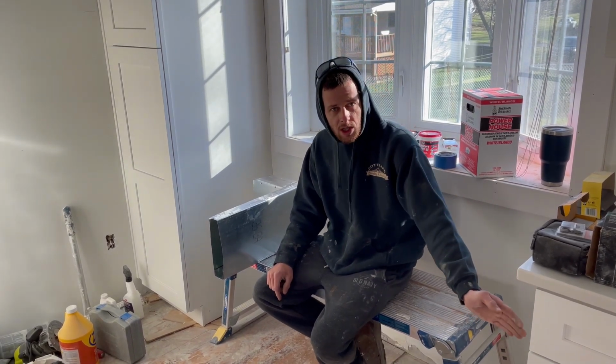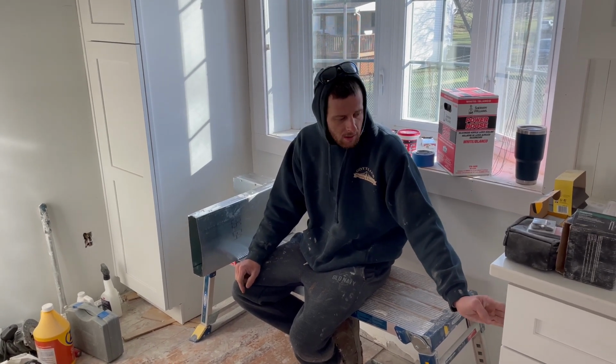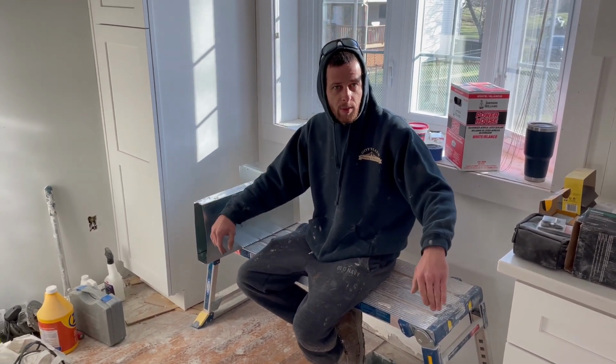Basically, we go 23 inches, and we do a 1.25 inch overhang. Our shiplap is probably about 1/2 inch to 3/4, and we'll probably put sheetrock on the front just to give it a nice flat surface. So that's about 1/2 and 1/2, 1 inch. Our finish is going to be 23 inches minus 1.25 and minus 1 inch. Our rough framing will be 20 3/4 to the edge of the cabinet. You've got to figure all this out before you build it.